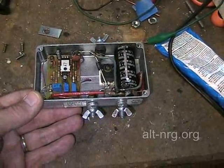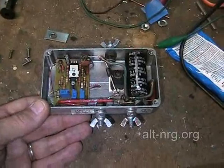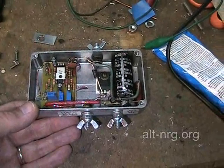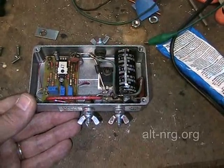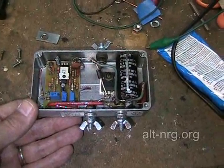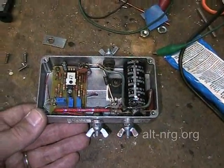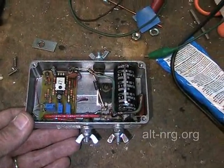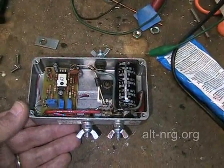The driver of the vehicle, when he reached a destination at a remote end, decided to change out the electrolyte himself and got it a little bit too strong. What happened was the peak impulse current that this pulse width modulator was attempting to drive into was off the map. And this is what happens when you drive a pulse width modulator into a virtual dead short.